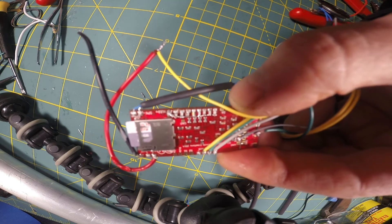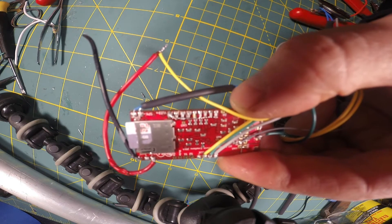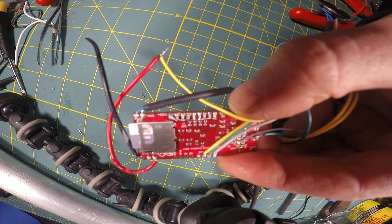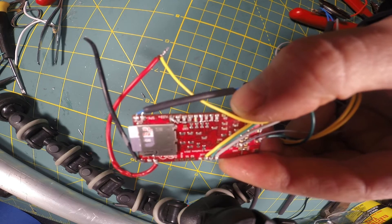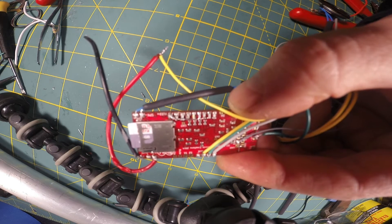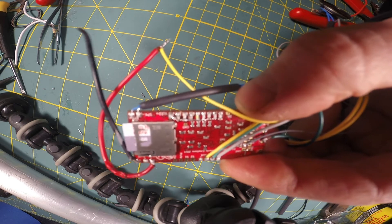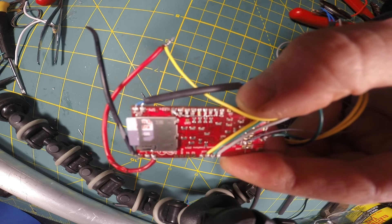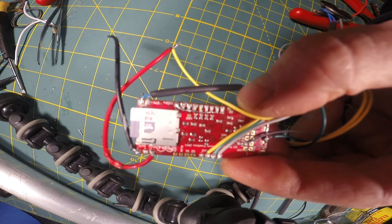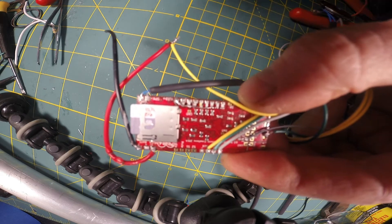The 3.3 volts is going to overdrive the reds and the ambers, but the blues and the greens are fine. I've wired a bunch of red SMD LEDs on these 3.3 volt pads and I haven't had any burnout, and if they do I don't care. You're talking cents for these SMD LEDs — they're cheap. So if they burn out, I'll just replace it, no big deal. It's a pretty neat skill messing around with these things because they're so much smaller and they're bright. Pretty awesome.